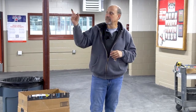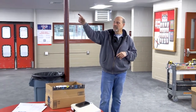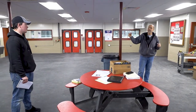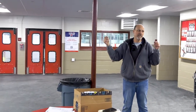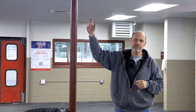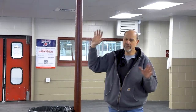For the warming room, adjacent offices, skate shop, concession room, and coaches room, the HVAC — and the only air conditioning in the building — is done through this ceiling-hung unit ventilator. There is a hot water coil in this that runs off the boiler heating system to supplement heat in the warming room and adjacent offices. Unit heaters around the facility supplement this in the heating season. There's a small condensing unit on the roof providing air conditioning for this area only in summer.